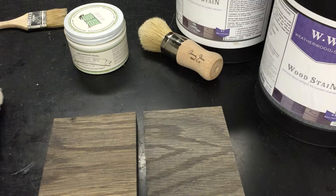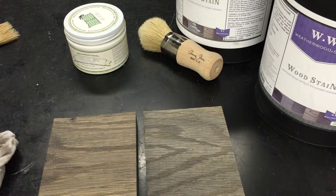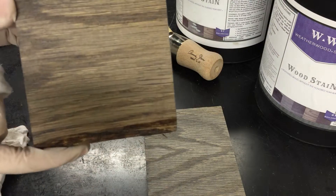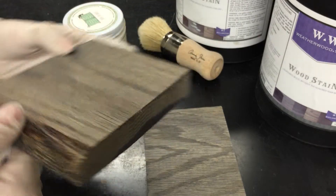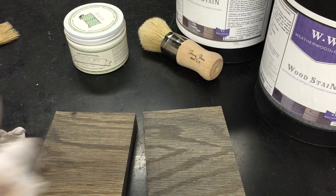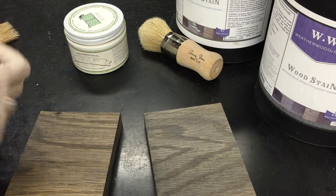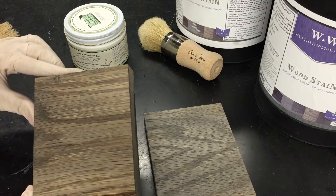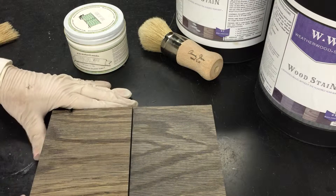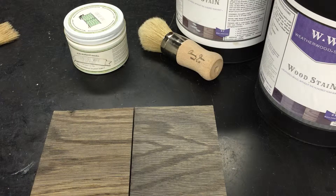Hey guys, so it's been about three to four minutes and I have my cotton rag. We've allowed the top coat — the wax — to impregnate into the wood surface, and whatever the wood was unable to absorb, we're going to go ahead and take that off with this rag so that the wood can cure and provide good coverage and top coat for the white oak. You can see it's still significantly more wet-looking; that's actually going to take one to two hours to start to look more like this one.